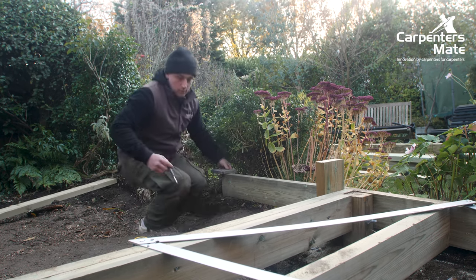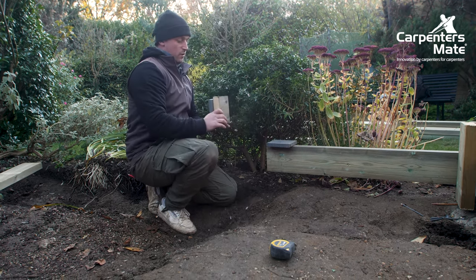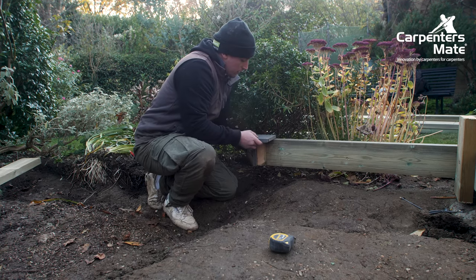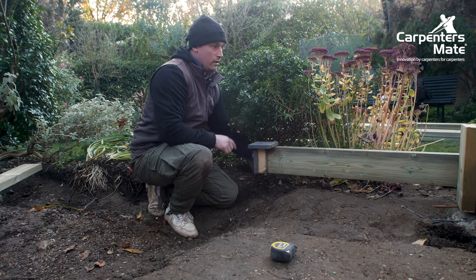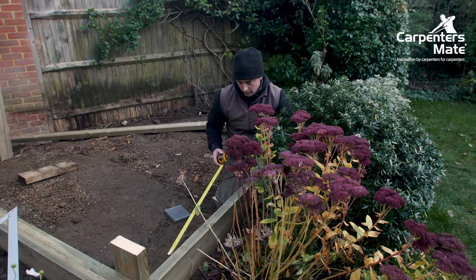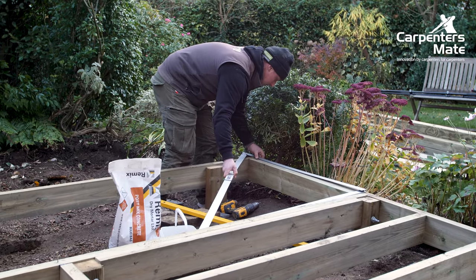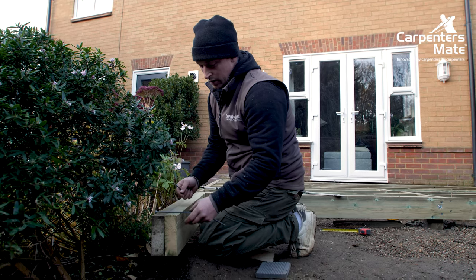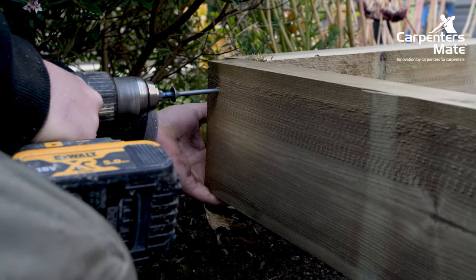On your last board you'll have this amount of overhang, and you want about 10 to 15mm overhang on the deck. Once you've got your outside joist, your deck sits 20mm as a fascia off of your last line, and you'll be left with roughly 15mm overhang — we'd recommend going no more than that. It carries on the whole way along the deck, so when you're happy with the amount, we know roughly where we want the step to be and can transfer this length of 99 centimetres, make a box section, level it up, and run some joists the opposite direction for these boards. When screwing through a double joist, always use a 150mm screw — you want to try and get at least 50mm into the next one.